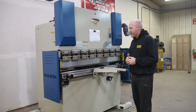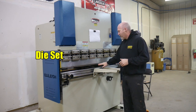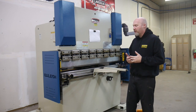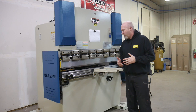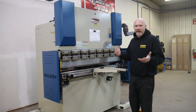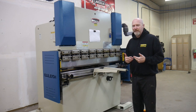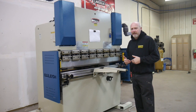Another great option is that it comes with a die set where the bottom die can rotate to seven different die opening locations. That's really helpful for a small shop because you can go from bending quarter inch on a two-inch die opening down to bending 14 gauge on a three-quarter inch die opening, and it really changes the amount of tonnage you need for those bends.